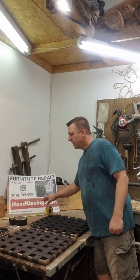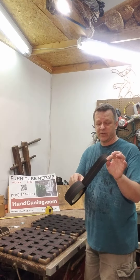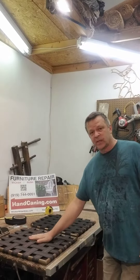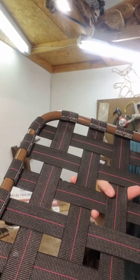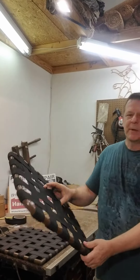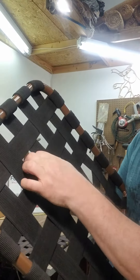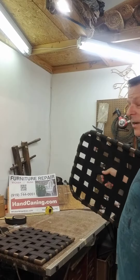I custom make them from the elastic material as you see here in a roll. I also custom make the clips. As you will see, the new one which is on this side underneath — I have these metal clips that get connected to the bottom of the chair. The original had the webbing put on there, but on the bottom side it wraps around and they actually twist it and staple underneath it. It's so flexible that the only way to do it is to actually pull it apart to staple under it. You can't do it with my material, so that's why I use the clips.